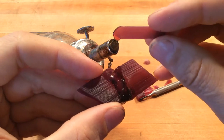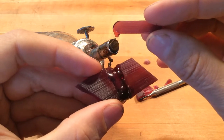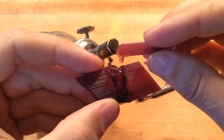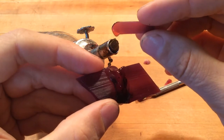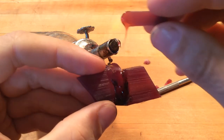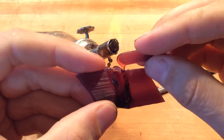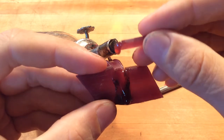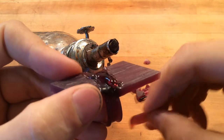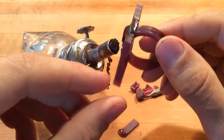And so you just sit there and try and figure out how you can add your material, lay it on hot. And this gives you a cleaner bond, but when I say cleaner, I mean your wax isn't dirty, but your joint looks like crap, right? So I'm just heating that up and building it up. And then you have to start alternating between rotating your part and your melting part. And then you'll see that all this wax here has flowed in an area I don't want. So I've got to bring it all back.